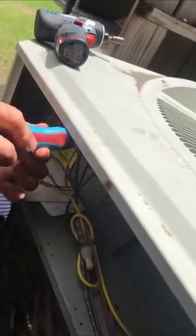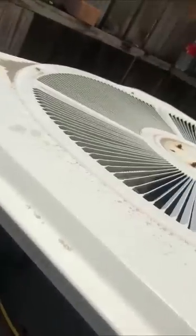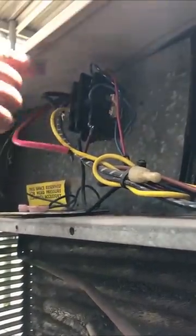What you want to do is isolate it. I've checked this compressor at the compressor and checked all the wiring. I'm going to isolate it from the circuit, because we know the fan's connected to that part of the circuit. My other wire here is hot all the time, and the fan's not connected to that since the fan's single phase, so we're disconnected there.